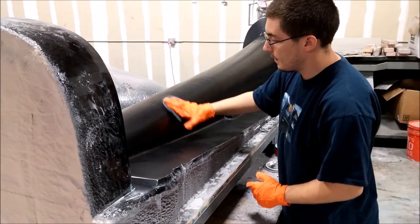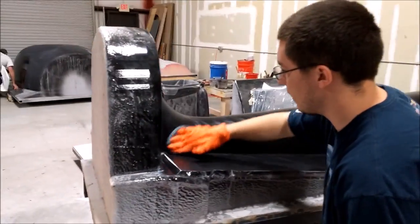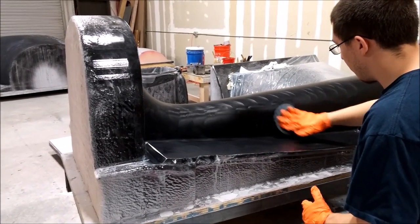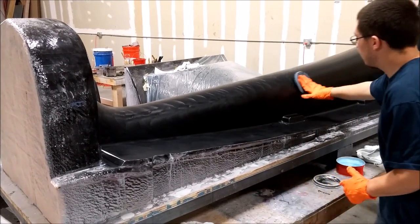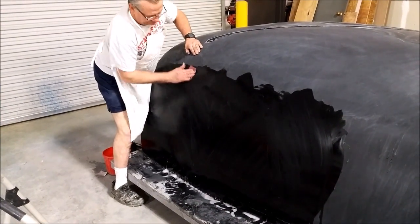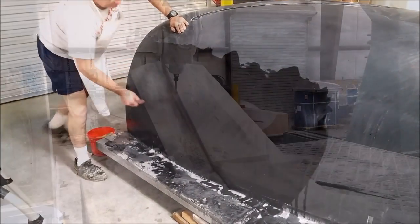In the meantime, here's Zach prepping the keel for next week — five coats of wax applied and the wax profile put on as well. We'll probably be pulling the mould off that next week, or laying up the fuselage, or maybe both. And here's Mark, who's moved up to 320 grit on the wet sanding of the roof mould — that's coming along nicely.